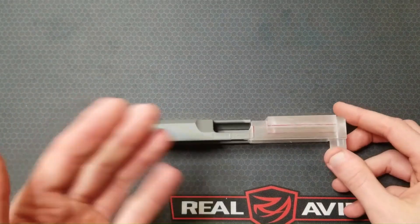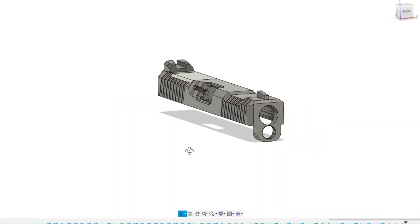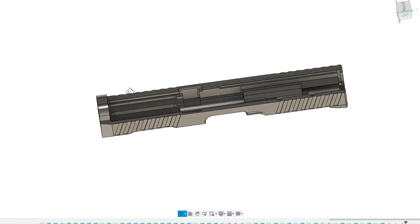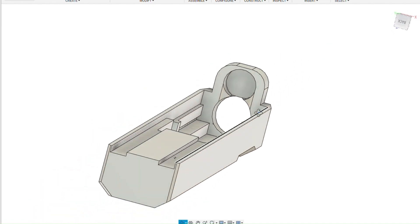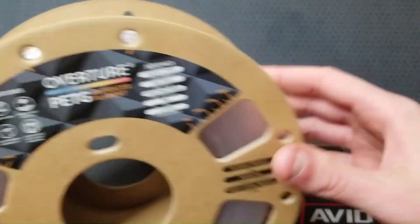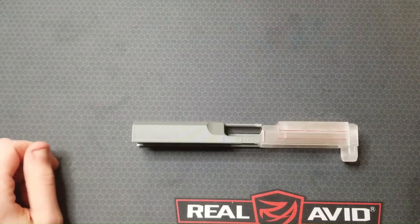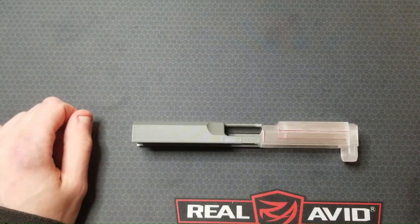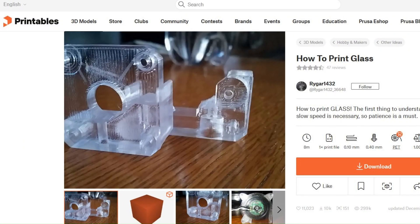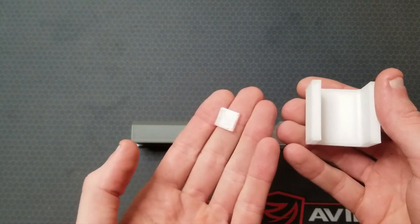I'm going to quickly go over the design process and challenges with this 3D printed slide. I had previously made a detailed 3D model of the slide for the bore axis comparison video, so I copied that model, de-featured and simplified it, leaving only the basic external shape and internal geometry needed to operate the locking mechanism. I bought some clear PETG for my printer, did a test print, and it came out quite opaque. I did some internet sleuthing and found that for this filament to come out clear, the printing parameters are very specific and a bit different than normal PETG. I'll link to both sources in the description if you're curious.